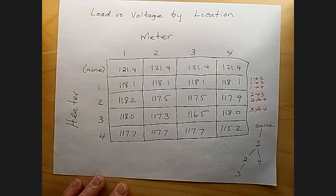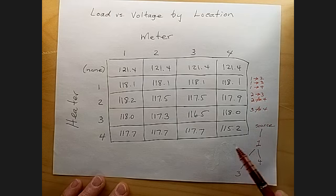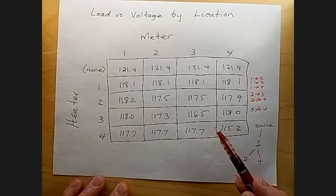And if we wanted to put in a breaker circuit that would shut off all of these, we would put it at position 1. Now, maybe there are other outlets further up here that would be even closer to the home run. We don't know that. We only looked at these 4 outlets.